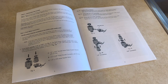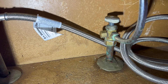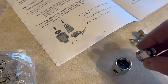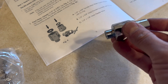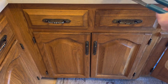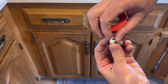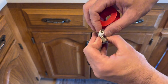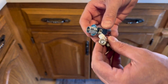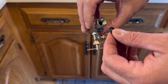Next, the instructions have us dealing with the water supply. This will vary amongst installations depending on what you have under your sink. I had the standard 3/8 fittings, so I assembled the pieces with the little shutoff valve as shown in the manual. The two adapter pieces have rubber seals, so get them super tight with two channel locks to prevent leaks. For the needle valve, wrap Teflon tape around the thread in a clockwise direction so it doesn't bind when threading in. Make sure the Teflon tape wraps don't obstruct water flow, then thread the needle valve into the adapter and tighten with channel locks. If the O-ring falls out, put it back in place.